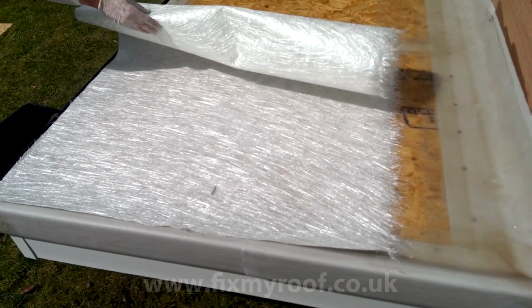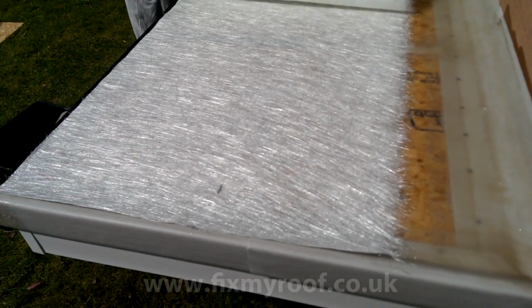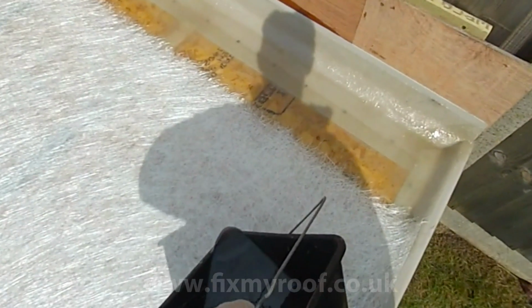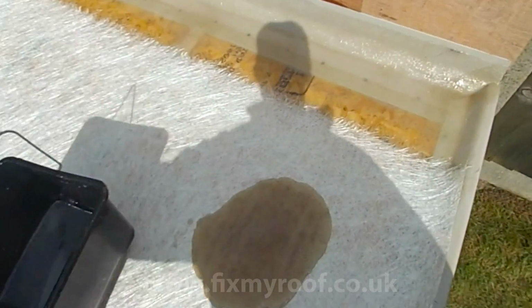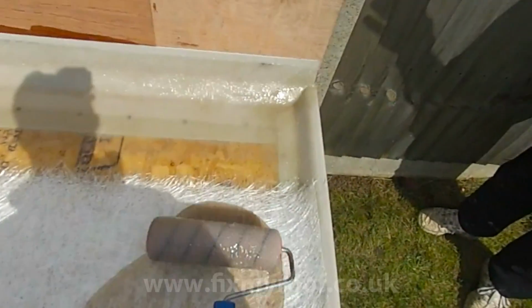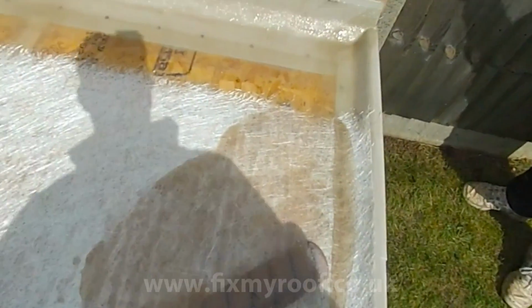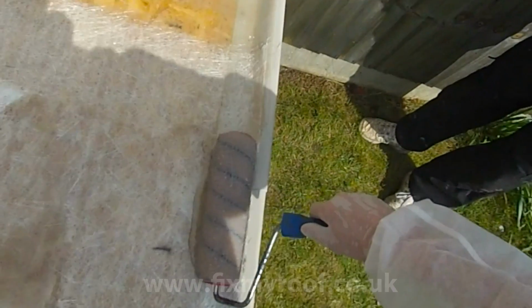Now roll out your C.S.M. into the wet decking and we can start again. Here I've started to use the pour and roll technique, which personally I find faster. Pour it on and roll the excess resin to somewhere that looks dry, then pour some more on and repeat. There is a downside to this though.